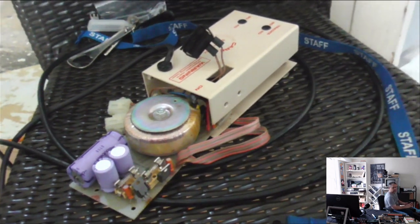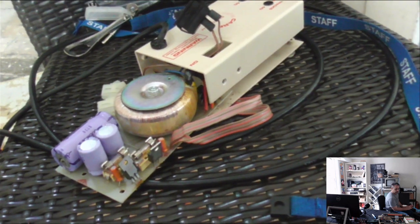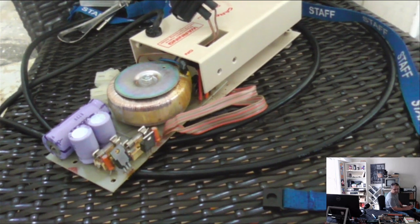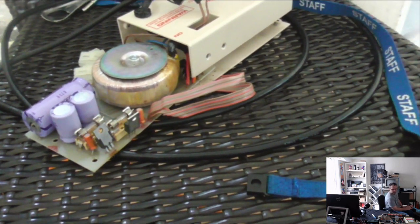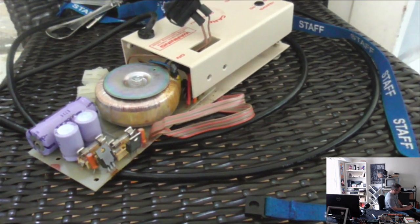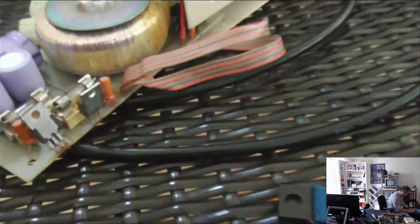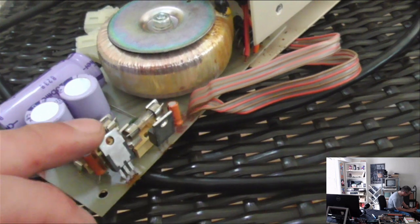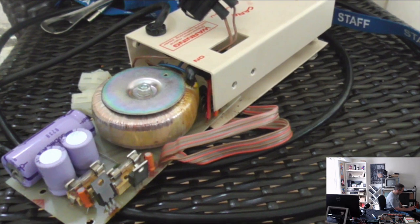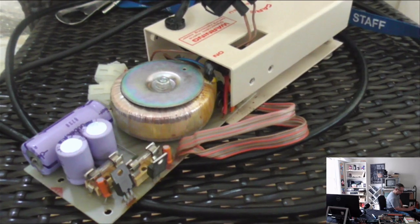So I got the machine up and running. I was able to type commands into it, try to load things off disk for about an hour or so. I just couldn't get any response out of the machine at all. I did my best, but the disk drives just ignored me. And then after a while I got to thinking, well, I haven't actually tested the power supply, so let's check that. And sure enough, this component here has absolutely had it. Look, that's not even connected to the board anymore. So that power supply is currently about as much use as a chocolate fireguard.